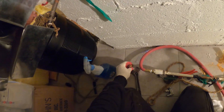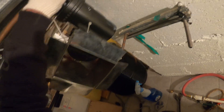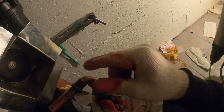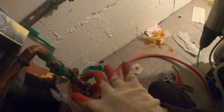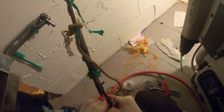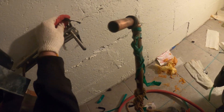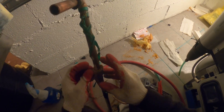I cut the pipe — I'm going to take this section with me. This one needs to be rebuilt. I'm going to solder a male pipe adapter, screw it on, and cut the pipe somewhere else so I can put a coupling to solder it without melting the Teflon on that male pipe adapter. Let's start by getting rid of all this tape. Also waiting for the smoke alarms to shut off — you always want to shut off your smoke alarms.